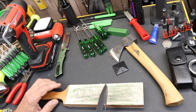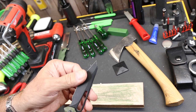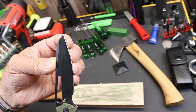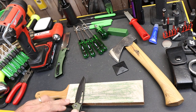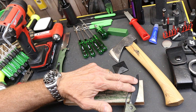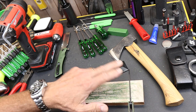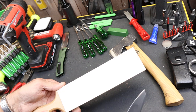What it does is it really takes things down from the large-scale stuff you can feel to the microscopic level — maybe even the molecular level. It polishes and aligns the metal on a blade. A strop is used in the opposite direction of the way we work with whetstones usually. As you notice, I'm not going towards the cutting edge, I'm going away from it — that's critical, because otherwise you'll just cut up the strop since it's just a piece of leather.